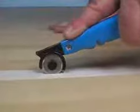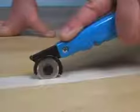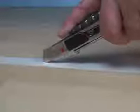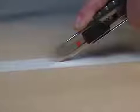Easily cut the masking tape with the rolling knife in the seam area. A straight blade or a hook blade can be used as an alternative to the rolling knife. It is important that the edges of the floor layers are not damaged while cutting the tape. This can be done effectively by pressing the knife's edge deeply into the seam, which allows for an easy-to-follow blade flow. After the seam cut, press on the masking tape tightly again using a seam roller to prevent the cold welding liquid from penetrating underneath the tape.